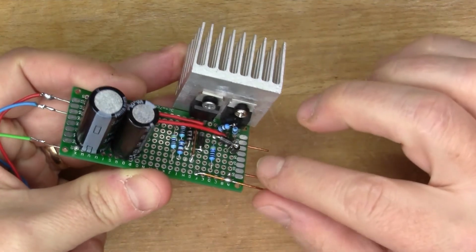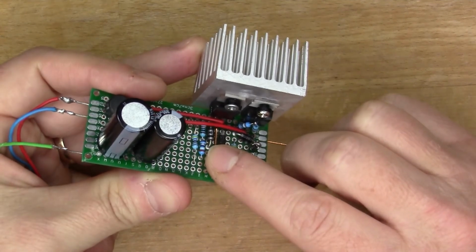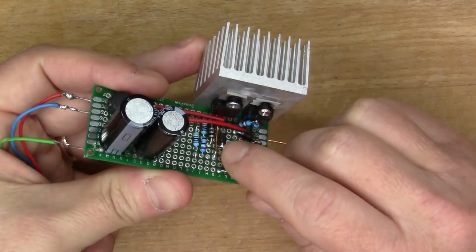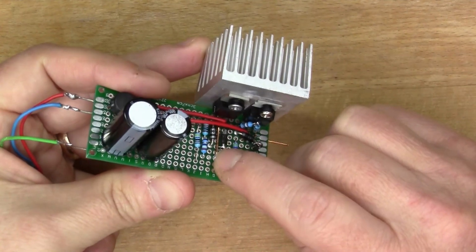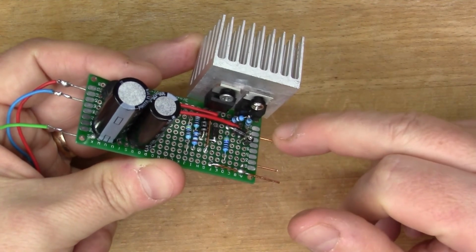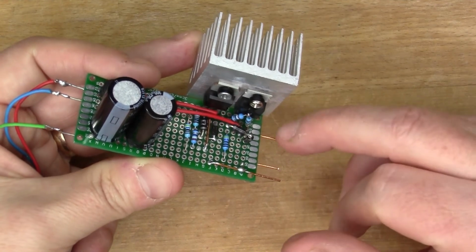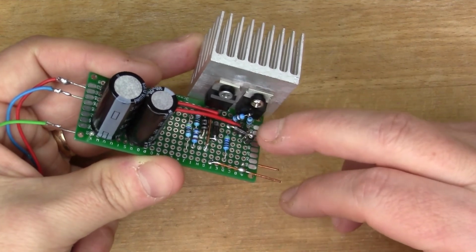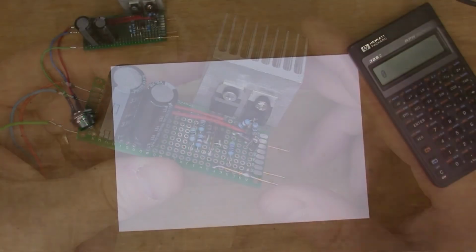And there are a few other ancillary components here. So we've got the resistors that select the regulation voltage, and also some protection diodes. There's a standard way to connect a couple of diodes just in case voltage gets put in here, to stop the voltage or spikes coming back from equipment and blowing up these chips. So I just put that in to give it a bit more resilience.